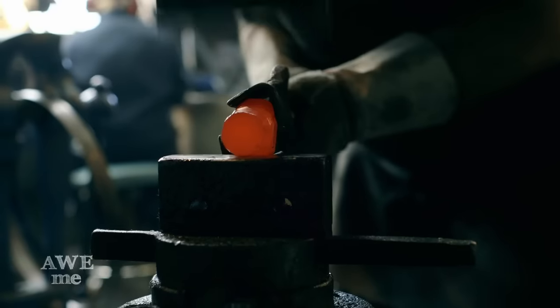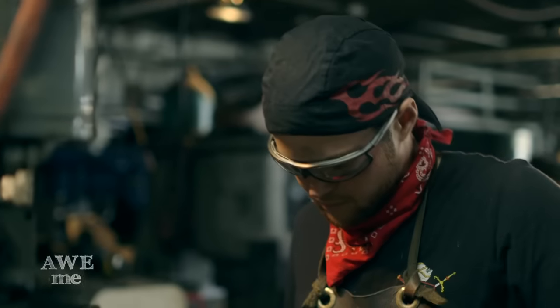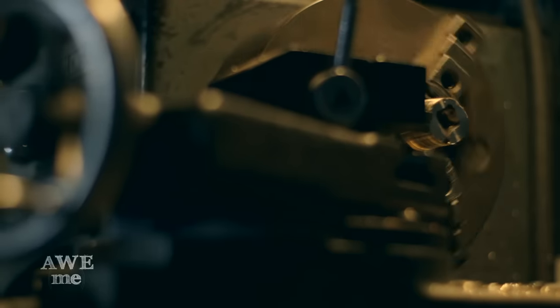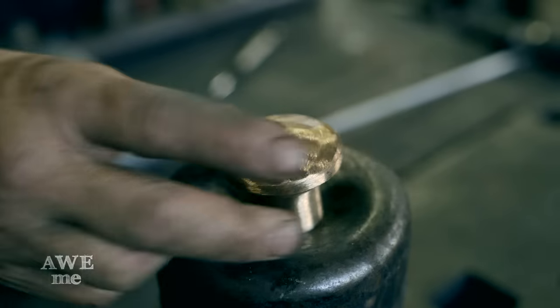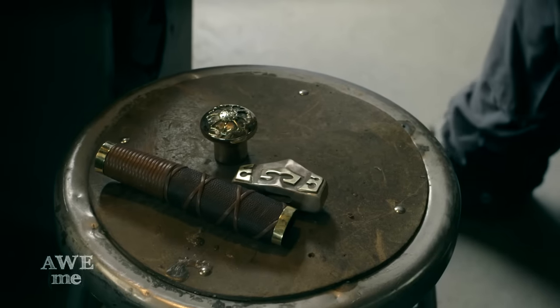I've also forged the bronze ingot to make the hilt and pommel. Brian has taken that to the mill, milled the slot in the hilt, and also turned the pommel on the lathe and drilled and tapped that. Alicia will be piercing out some lotus flowers in brass, and we'll solder those on top, so we'll have a two-tone effect of gold brass and more reddish bronze underneath for the hilt and pommel. The grip will be covered with brown leather, then a lighter brown leather wrap over the top in a criss-cross pattern, with brass bezels around the top and bottom to hold everything together.